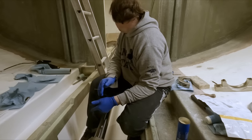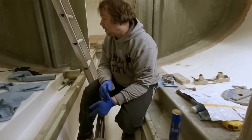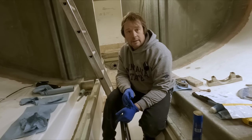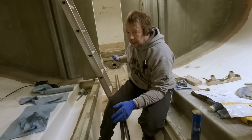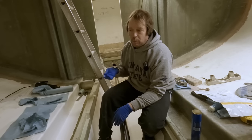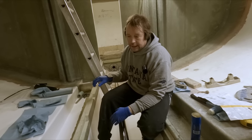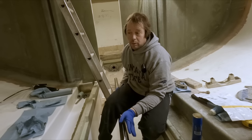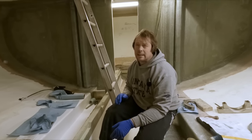So we've just basically made an assumption, which is usually a bad thing to do, especially when it concerns old equipment and prior installs. We just assumed that the stuffing box was aligned correctly and straight. We based that on not seeing anywhere on the inside of the stuffing box where the shaft would have been rubbing against it, and the fact that the babbitt bearings that were in here looked like they were wearing evenly and there wasn't excessive wear. But like I said, that was probably a bad assumption.